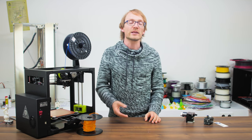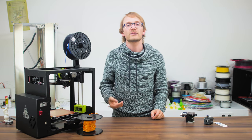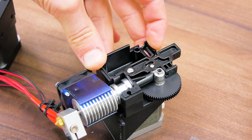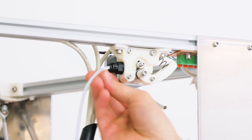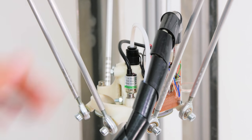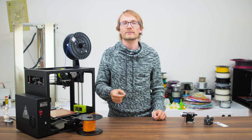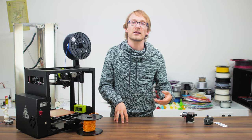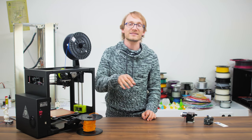The next big choice is going to be Bowden or non-Bowden. Normally, you've got your hotend strapped right to the extruder, often even mounted right in there. But if you're going for a Bowden setup, you'll have the hotend decoupled from the extruder with a Teflon tube. This means there's going to be less weight to lug around as the hotend moves, but the distance between the extruder and hotend will introduce some backlash to the filament drive. If done and set up correctly, it's not going to be a huge difference for your print results.